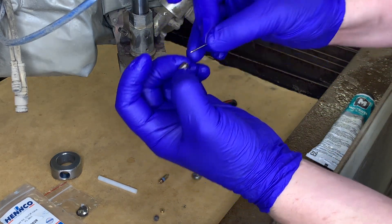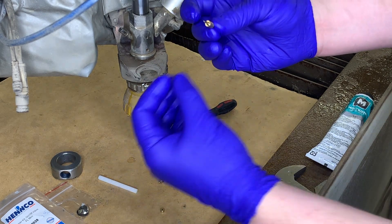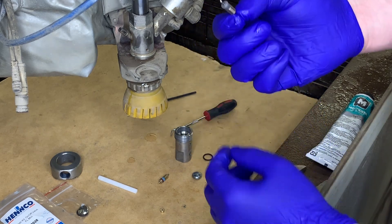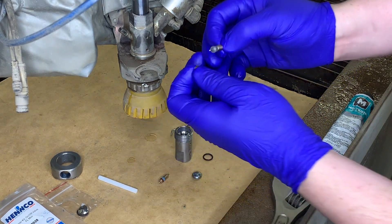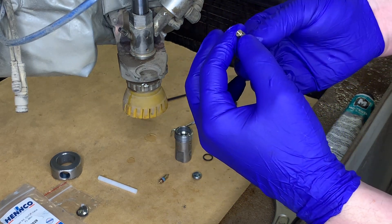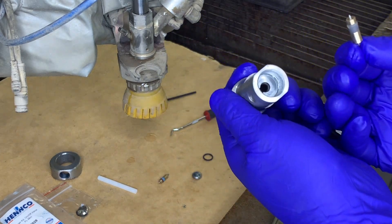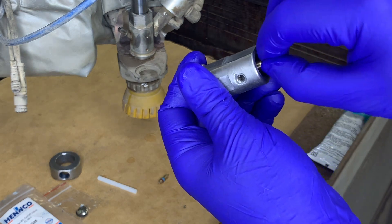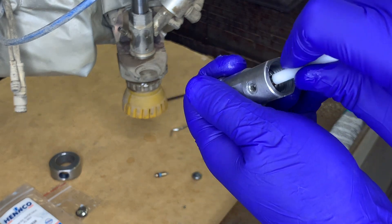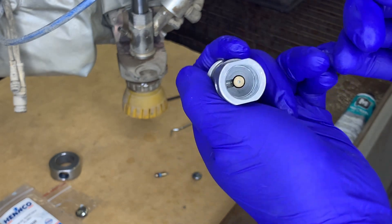Let's jump in and start assembling these items on our needle. First, take the needle and put the bushing on with the concave side facing the tip of the needle. Next is the high pressure seal, making sure again that the o-ring is facing the tip of the needle. And then lastly, put on the backup ring, which is symmetrical. We can then take our needle with components on it and press those into the top side of the valve body. Use the plastic dowel to push or seat all items inside the valve body.